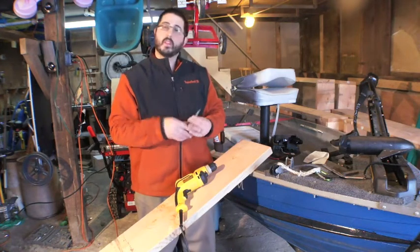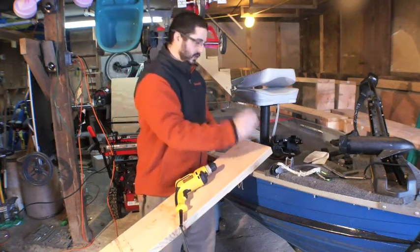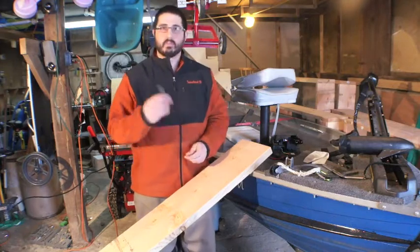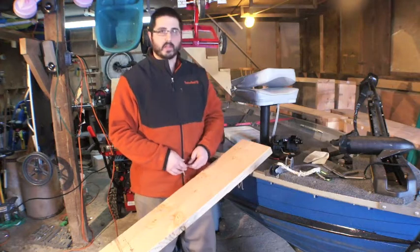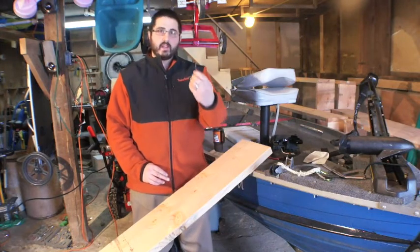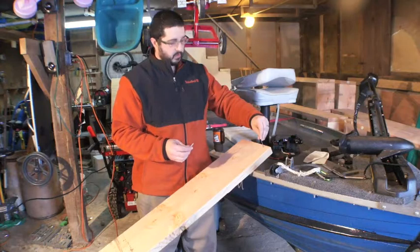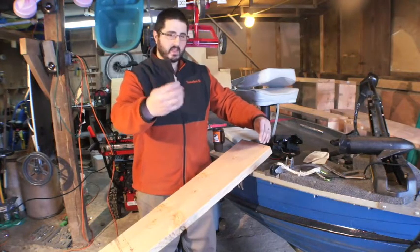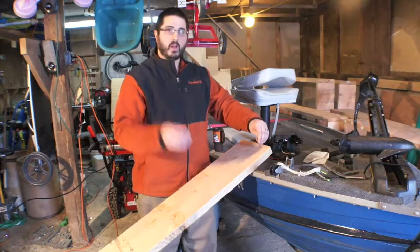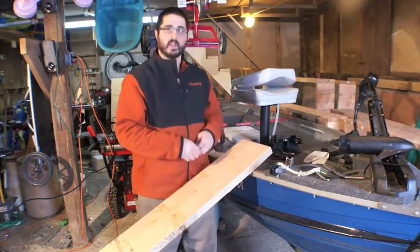Pilot holes. One of the things I learned growing up building many things is you've got to drill pilot holes. Never just take your screw and screw it directly into the wood — that causes your wood to split, and then you've got to go back to Home Depot, which for me is a half hour away. Pilot holes: you've got to take a drill bit that is smaller than your screw and drill holes where you're going to put your screws. Otherwise, you put your screw in, it pushes the wood, splits it, and then you get all mad. Drill the hole — that allows the screw to go into the wood nice and even. No splitting. Everything just glides right in and your life is happy.